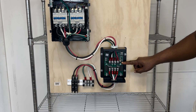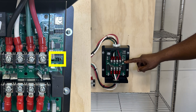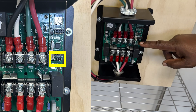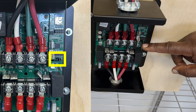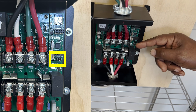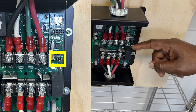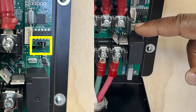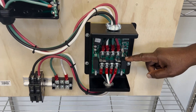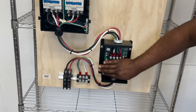Another key thing is this little jumper here. This tells the logic that there is a surge board mounted. This jumper must be sideways or removed — when it's the other way, that means no surge protection. Right now it's sideways, which means there's a surge board that would be here.